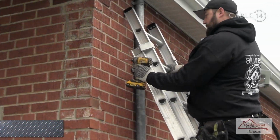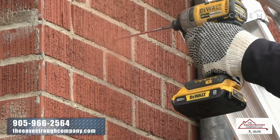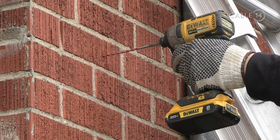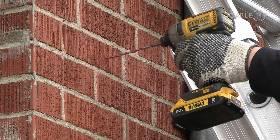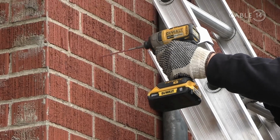Now, Joe, one more at the top. Yep. So two for strength. You want to make sure that you add two. Okay, makes sense. Doesn't matter if it's a bungalow or a two-story. Two's enough. I don't hire anybody that does one only. And if you go three stories and you've got a three-story pipe, three straps would be a strap per story.